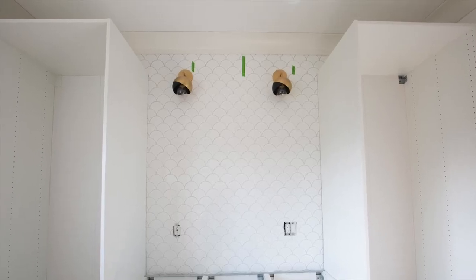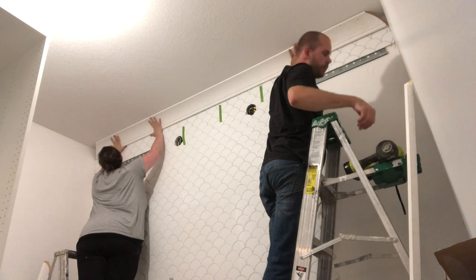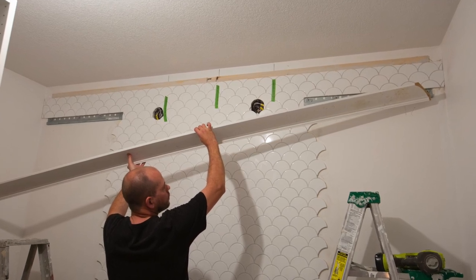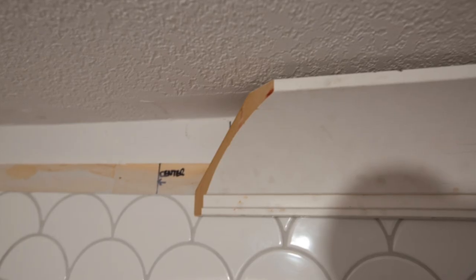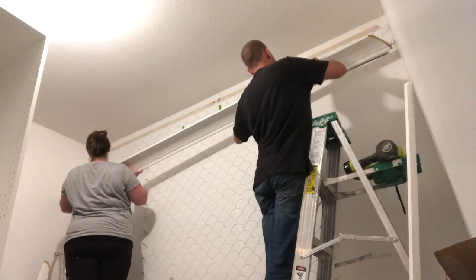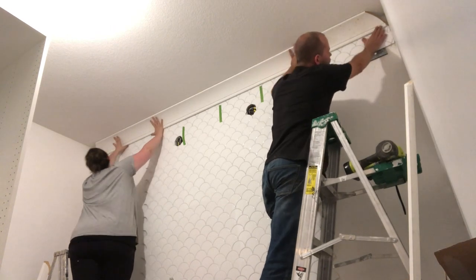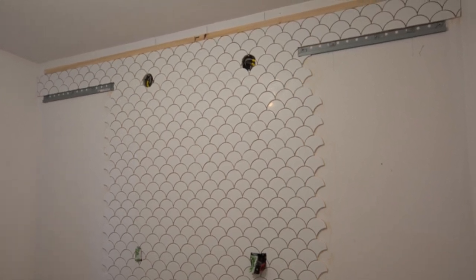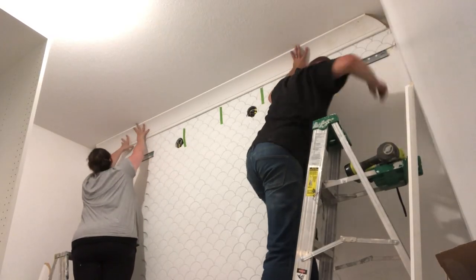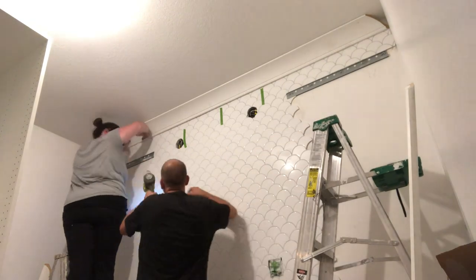When we were renovating the office, I wanted a fully tiled wall behind my cabinets, but you can't nail into tile, so we had to come up with a creative solution to put crown molding above the tiled wall. What we did was cut a piece of wood the same thickness as our sheets of tile, then used a piece of crown as a reference and nailed that board to the wall slightly above where the bottom edge of the crown would sit. This way the tile still goes underneath the molding, but the wood board is there to nail the crown into. Once that board was nailed in place, we started tiling directly under it. Once the tiling was done, we marked all of our studs — you can see them with the green tape in the video — so we knew exactly where to nail the crown to make sure we were hitting studs.